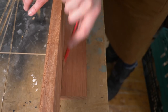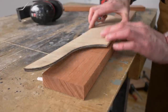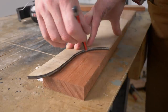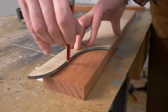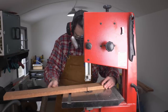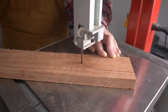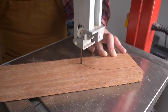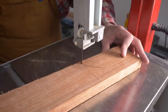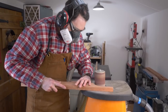It needs to be cut out at either end so it can hook over the side of the bath. I mark out the thickness of the wood, leave that at the top, and then draw a curve on the bottom using a template I have for something else. I can then take the pieces over to the bandsaw and get that curve cut out, then use the spindle sander to clean up all the saw marks.